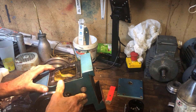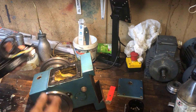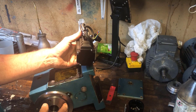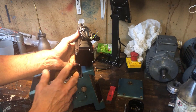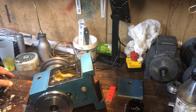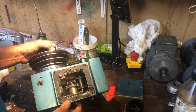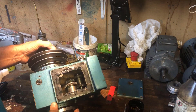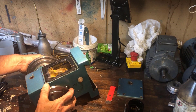So I don't really need the gears here either, because of the fact that I'm running this motor, which will only need the input from the tachometer — the encoder — and controlled by this controller box. So this may just be left inside there, and this is taken away. Then I'll mount the encoder maybe to one of these gears — we'll see about how I do that.